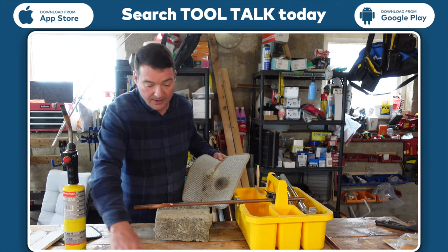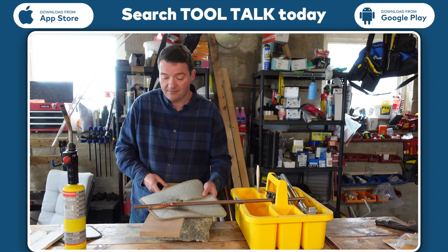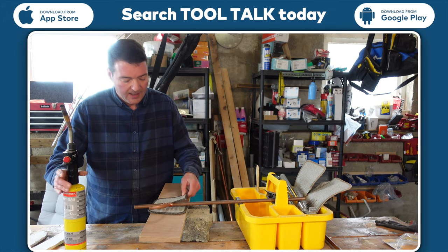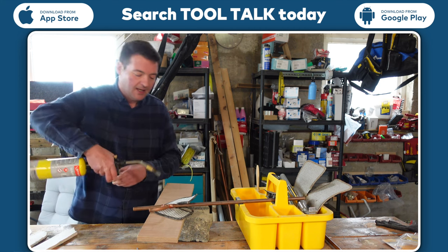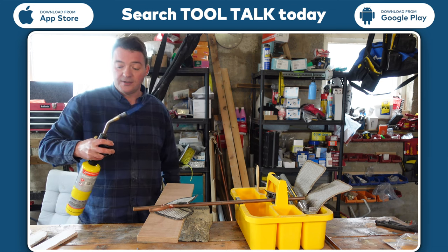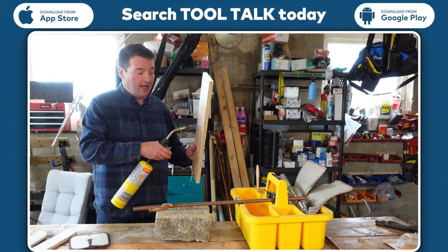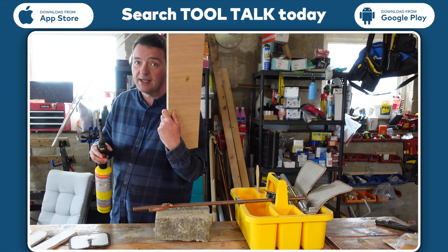And to show one even closer — this is a bit of furniture board, which does not like heat. We'll need the small mat this time. Put that back inside my sweatbox, which we're using quite nicely to hold the pipe — quite a tool, showed that in a previous video. Put that on there, try to make it not touch the red hot pipe. And again, we'll just solder away, put the lock on — I'm able to go right against the furniture board with no problem. Absolutely no marks on that whatsoever. But furniture board, as we all know, is no friend of heat and it will burn very, very quickly without a mat in place.